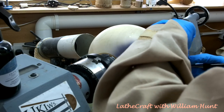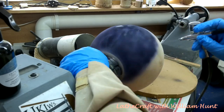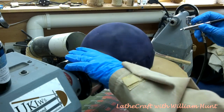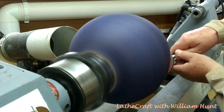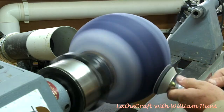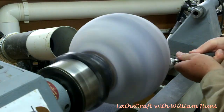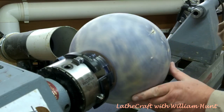Having got a good heavy layer of the Midnight Blue Intrinsic Colour, I need to leave this to dry for about 10 to 15 minutes. As I mentioned, I'm going to sand away most of the midnight blue colour, hopefully leaving some interesting highlights. I started off this abrasive process with 400 grit, but pretty soon had to revert to 240 as it wasn't removing enough of the blue.